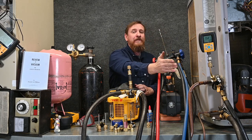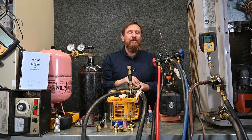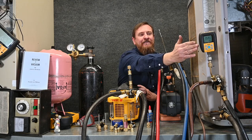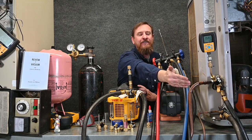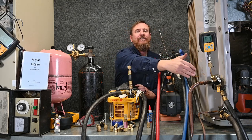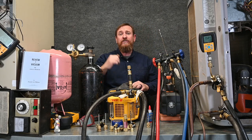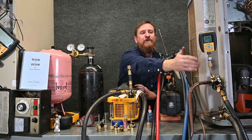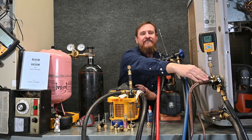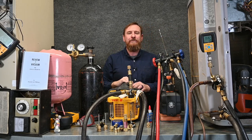Cleaning your micron gauge is still going to be important — make sure you follow your manufacturer's suggestions and use what kind of cleaner they recommend. Also, having your valve cores removed is going to be important. If I have my micron gauge on the outside of my valve cores, I'm not getting an accurate reading of what's happening inside the system. There could be several hundred to even a thousand microns difference, as we saw in the examples before. With those valve cores removed, I'm able to see what my microns are doing right here in the system.